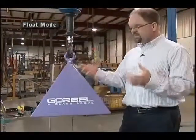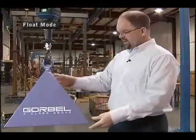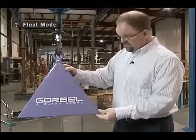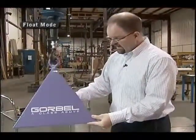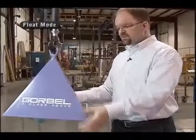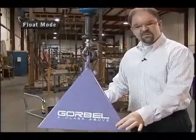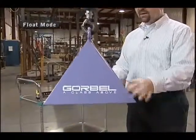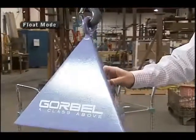Float mode is very important if I'm positioning something at a very specific point — for instance, going to a production line and getting onto locating pins on an engine or transmission assembly. It's also very useful for orienting something on a horizontally oriented spindle or bolt pattern, such as placing it onto a spindle or lining up bolt holes. This gives you fingertip control up or down, with up to 660 pounds or 300 kilograms of capacity.